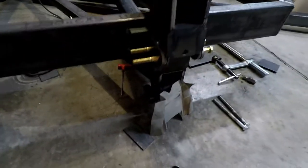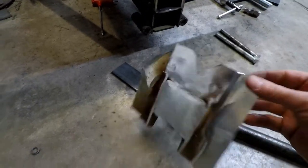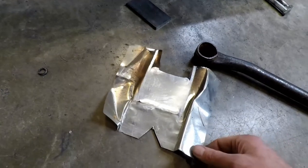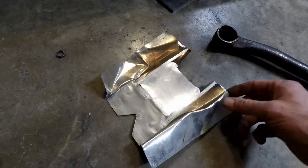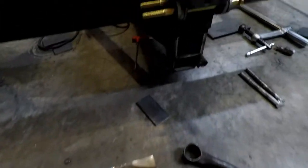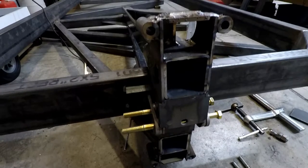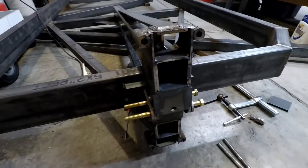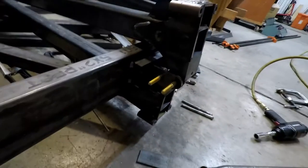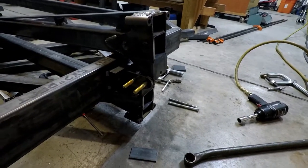So when I put it together and welded it up, I had this piece of tin in between. You can see weld splatter and other things that got squished — I had to hammer it around to have access to certain things like parts to weld. But that protected the joint and it also gave just a touch of separation, so that when it was welded together it would come back together with just a touch of space.